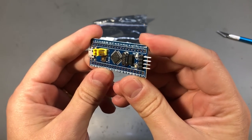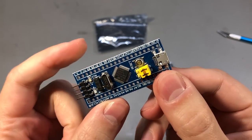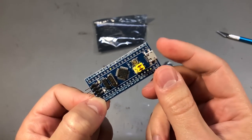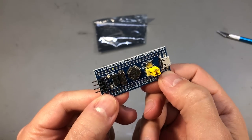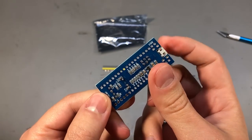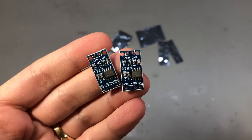Next I have a dev board based on the popular STM32F103 microcontroller from STMicroelectronics — or so you would assume. There are replicas of this microcontroller that are laser etched to look like the original, then assembled on cheap dev boards sold on AliExpress. Those replicas can run the same code 99.99% of the time, however there may be limitations with timing, bus speeds, or slightly higher power consumption. Not a showstopper for hobby projects, but it's good to be aware when something seems not quite right.